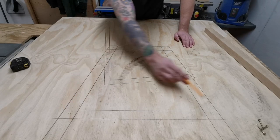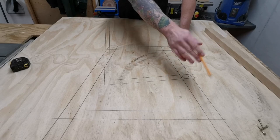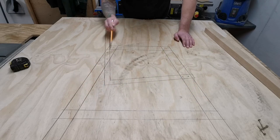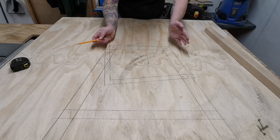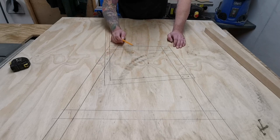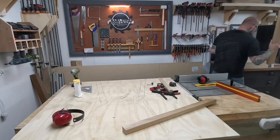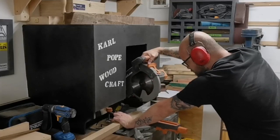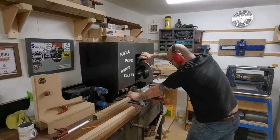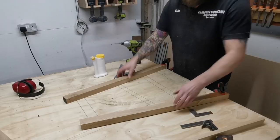These cuts are going to be half lap joints, and all the cuts are at 10 degrees — the top cuts, the foot, and all corresponding cuts. That's the great thing about a frame like this: they always correspond together. I did the exact same when I built the rustic firehouse table, but we only used pocket holes then — now we're using half laps. The initial 10-degree cut is made on the base frame of the chair, and from there we put these flush with the edge of the plywood which is square, then mark out the remainder of the cuts.